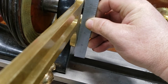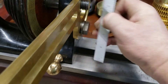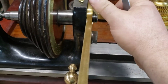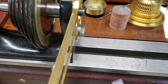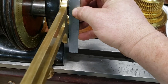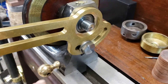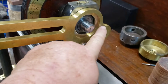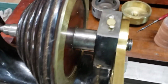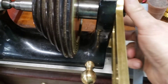It's bent in at the same time. This piece of brass isn't the same thickness everywhere, so even though when I pull it down it pulls the top out, it's still bent down here — you can see the little gap down at the bottom. So my next project is I'm gonna stick it in the press and try to bend it across here, down ever so slightly, to get rid of this little gap right here, so that when you tighten up that bolt it's up flat against the face of this lathe.